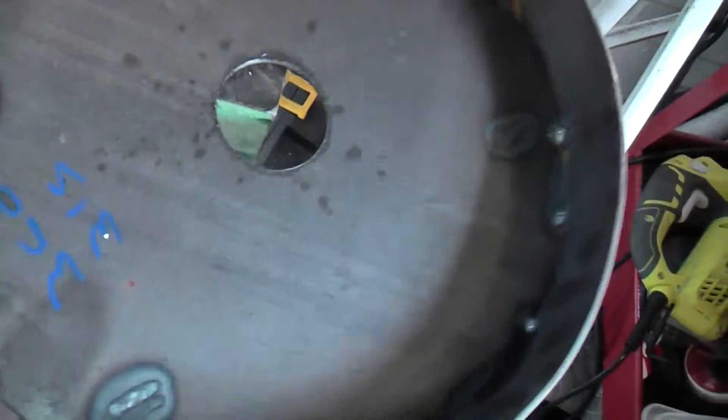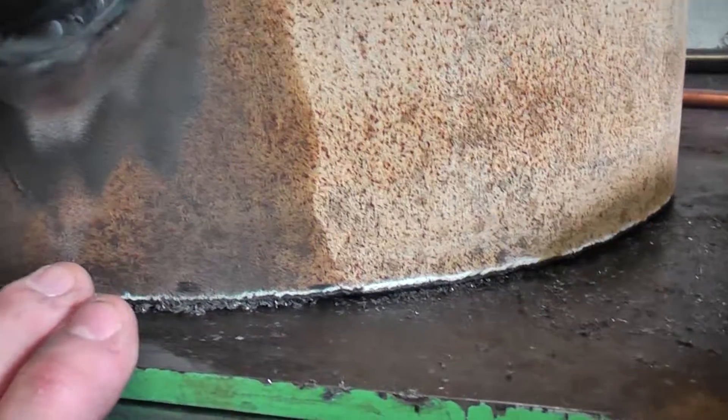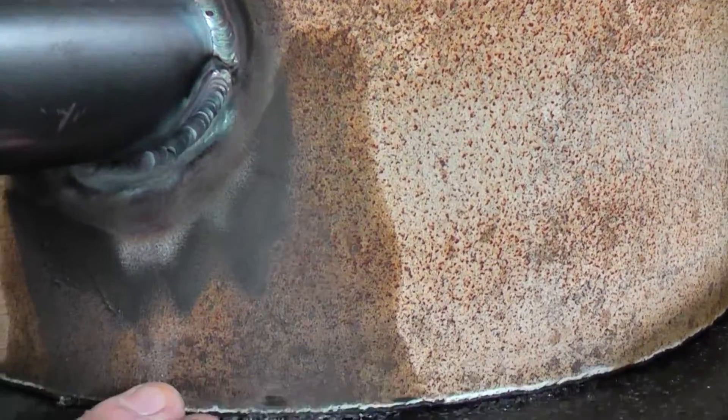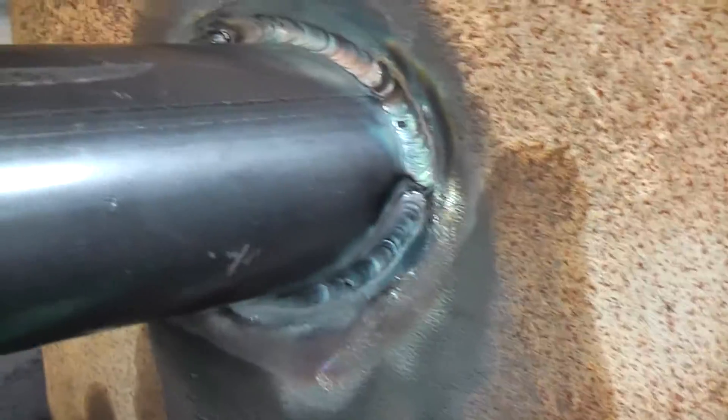So let's take this off and look at how I've built it. It's cut from a gas bottle. The reason it hasn't got the original base on it is because many years ago I built a charcoal fire furnace from a gas bottle and the base of that is just out there with the original pipe. This is going to be a lot better than the original one because it's actually going to have a refractory lining. I started off by welding the base on. Looking inside you can see it's all fully seam welded, with some handles tack welded on the outside and on the lid.